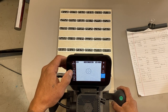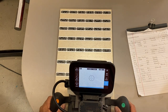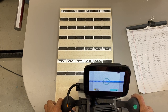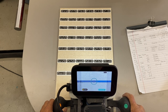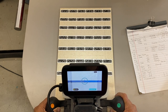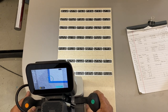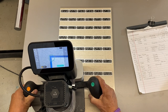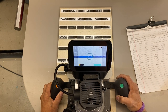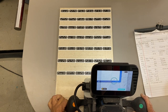At this stage I had plugged in that 10 thousandths offset. I'm going to change that to zero offset and set the final depth of 3/32nds deep and make another cut. I'm in auto mode, and right here I moved the router a little faster than the speed that was set, so I changed that back to the default of 10 — which I believe is 10 inches per minute. I typically like my forearms resting on the table; you have better control with the router. I really should have moved the solid surface back to achieve that.